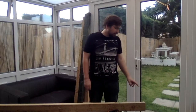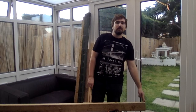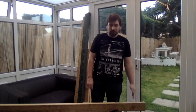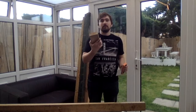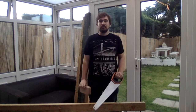What I have just done is I have marked up a 90 degree angle on this end and a 45, and then split the difference so I get the 22.5 degrees. I am going to be using a normal handsaw and I am just going to use a 90 degree bit of wood to keep my cut straight.